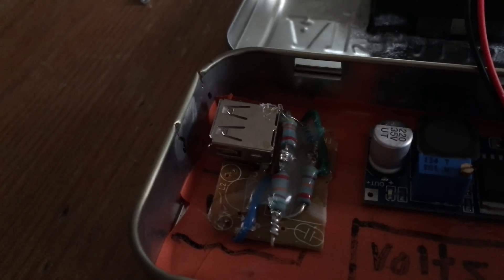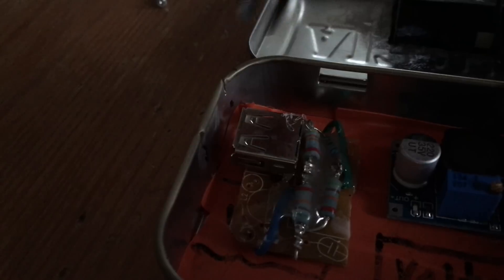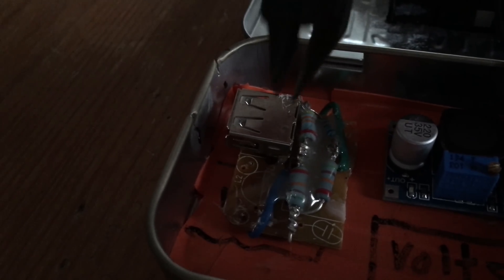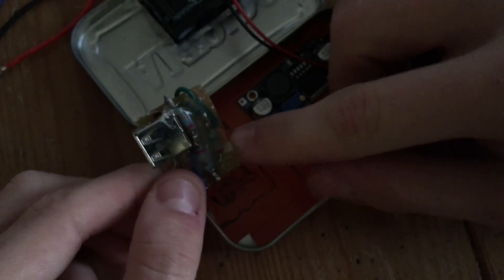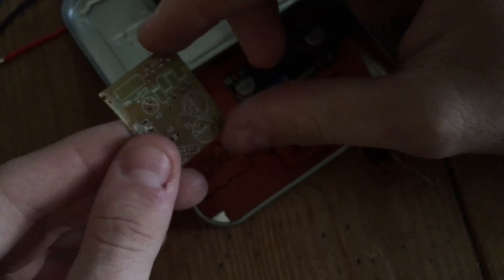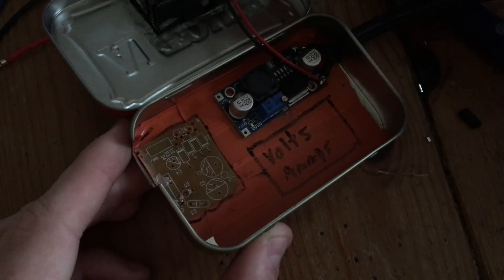In order to facilitate USB charging, the USB port needs a hole cut into the side of the Altoids tin so that it can stick out. We're going to use wire snips to cut down the side of the tin and remove a piece of metal by bending it back and forth. Now that the hole is cut, it's time to glue the USB port and associated board in place. I'll elevate the board a little off the bottom so the USB port is not angled up and awkward to plug into, by hot gluing down a scrap piece of depopulated circuit board first, then gluing the other circuit board on top of that.